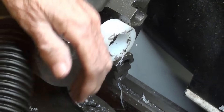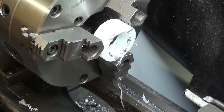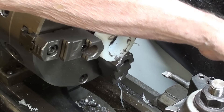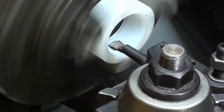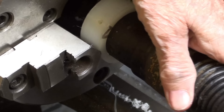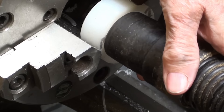Here's the slug that came out, but naturally this isn't going to fit yet — I have to bore it out. On second thought, in retrospect, like being a Monday morning quarterback, I used an inch and a half, but I do have a one and three-quarter, and that's probably what I should have used — maybe I wouldn't even have needed to bore it. But anyway, I'm committed, so I'll bore this out to about one and three-quarters, a little bit less. One more pass, just a few thousandths more.